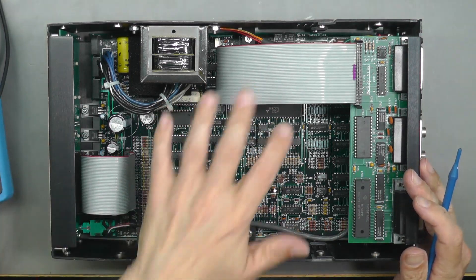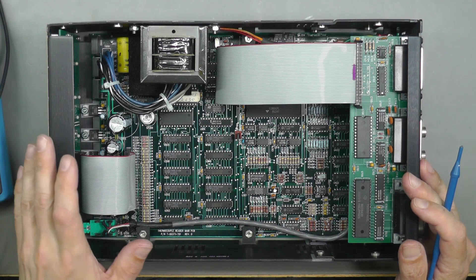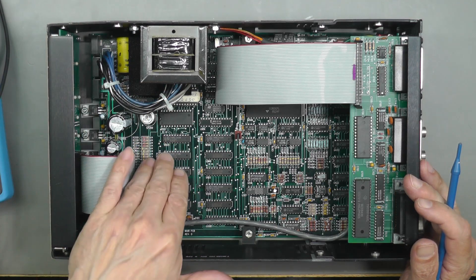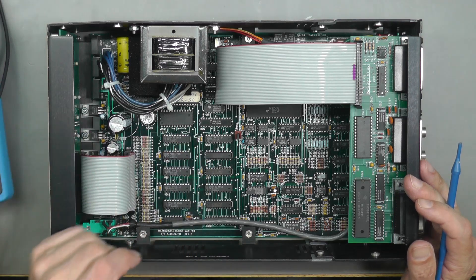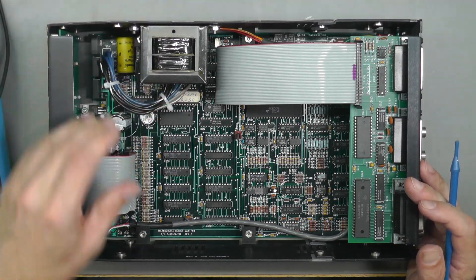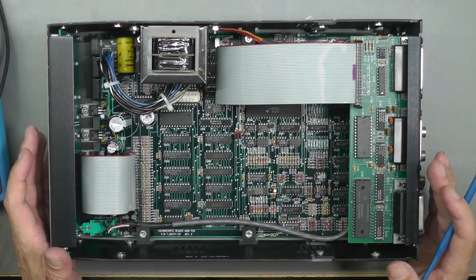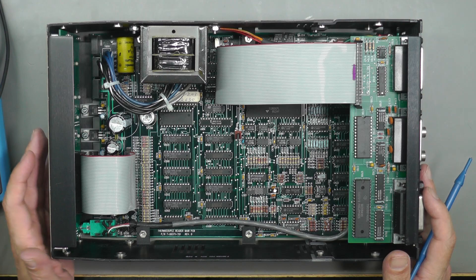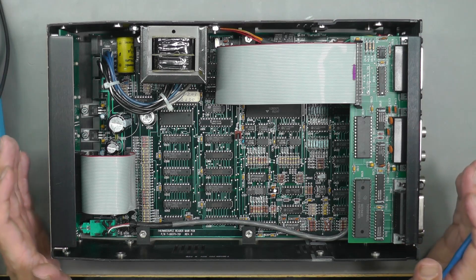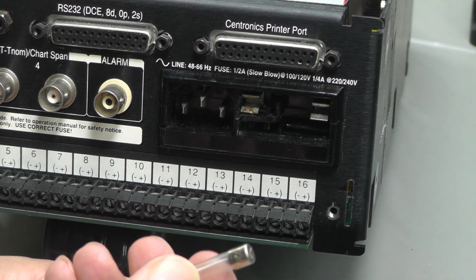All back together again — ribbon cables back in, all screws back in and tight, transformer back in and tight. I've measured across the 5-volt rail at one of the 74-series ICs and it's looking good — no dead shorts. Everything looks ready for a power-up. I'll measure across the AC input, make sure I'm not getting a dead short and that I can see the primary of the transformer, then attempt to power up. The fuse is the correct half-amp fuse and it looks okay.